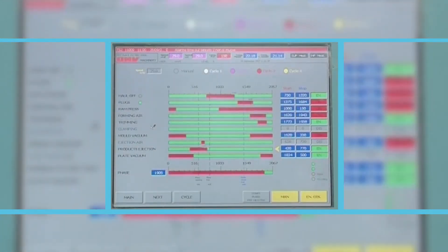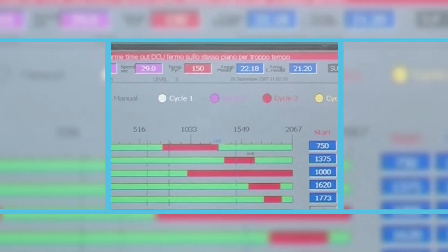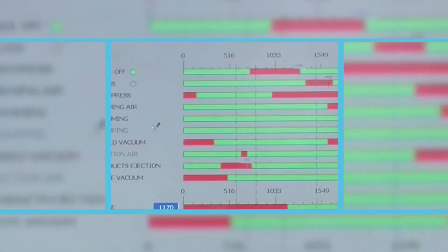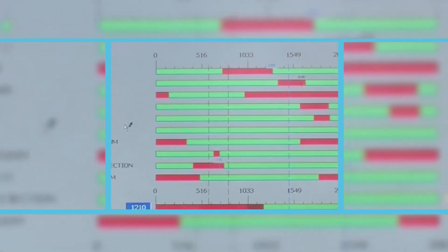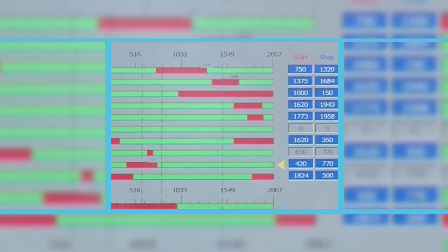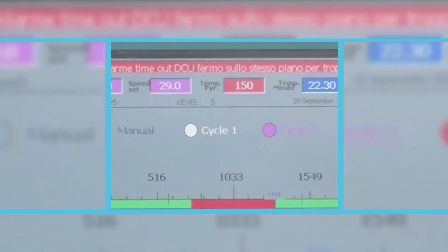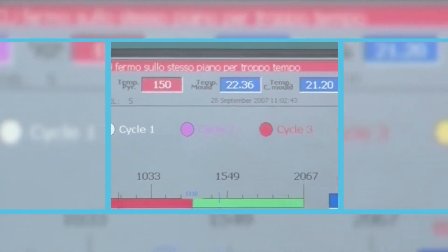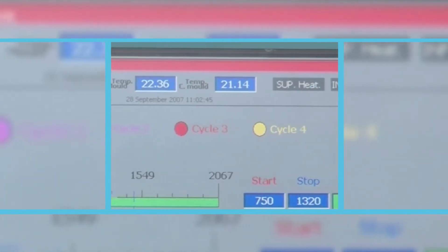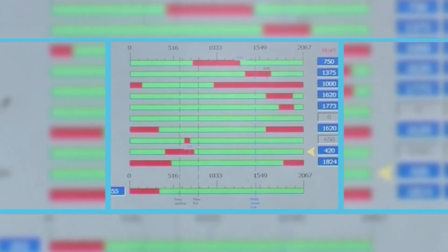It's well known that the maximum production cycle rate is determined by both the product stabilisation time, referred to as the active period, and the product collection and stacking time, referred to as the inactive period. The inactive period is also related to product depth. For example, with the F87 thermoformer, it's possible to achieve an inactive period of 1.4 seconds, running products of up to 100mm depth.